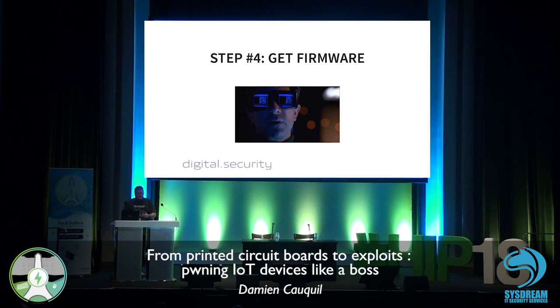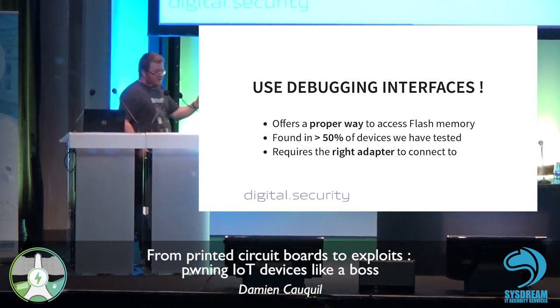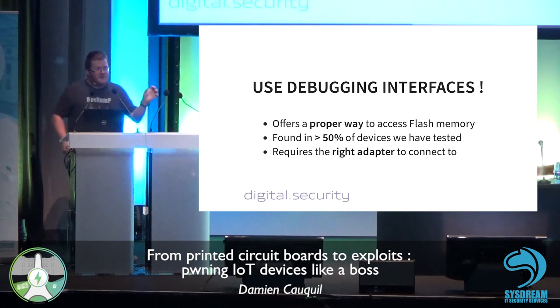Maybe some keys, maybe we can determine how this smart lock works, maybe some kind of backdoors if we can reverse engineer this firmware. So we are going to use a very simple way to do this, by using the debugging interface. Previously I determined that the four-pin connector near this nRF52 chip is a debugging port. So I'm going to use it to extract the firmware.